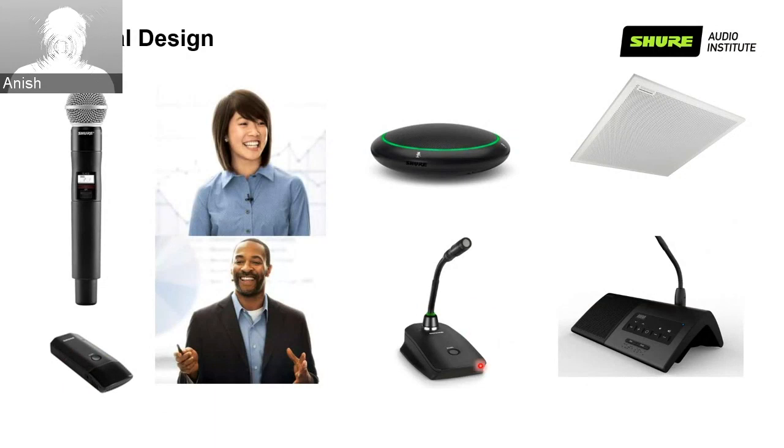Next is the gooseneck microphone, also commonly seen in conference rooms. They are designed to overcome some challenges with boundary microphones — for example, if a person is using a laptop, the laptop screen can cover the speaker and the sound might not reach the boundary microphone. That's where goosenecks come in as a more helpful design, because the long stem makes the microphone element closer to the people who are speaking. It also provides excellent gain before feedback and the additional benefit of reaching over a laptop screen or a writing surface.